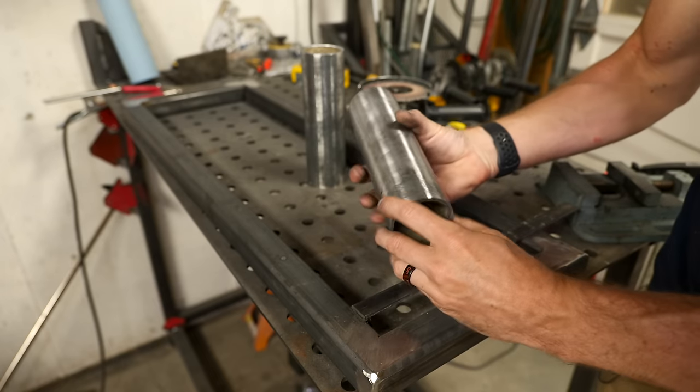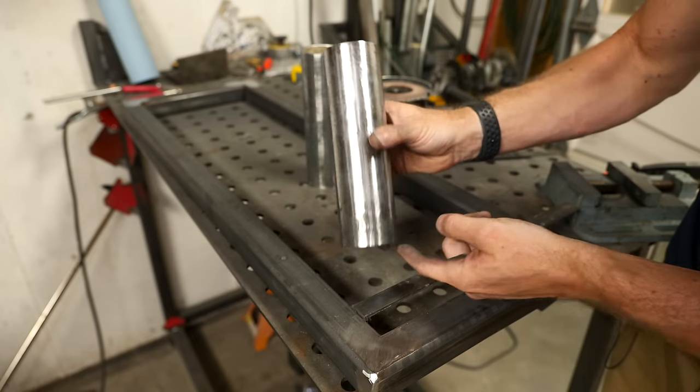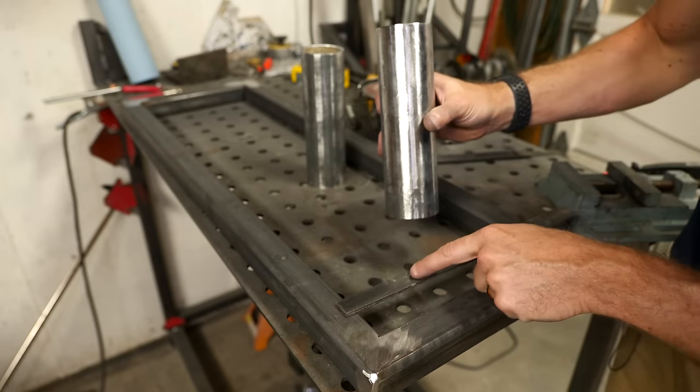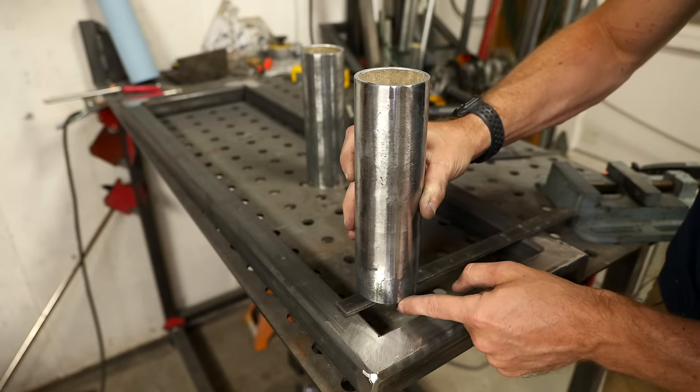These pipes are just about cleaned up and ready to be welded in, but I want to put something at the bottom of them — that'll give me a floor where I can put a piece of foam so when the barbell goes in it doesn't hit the concrete below. I've got a little strip of metal here. I'm going to weld it on the bottom of the frame underneath each one of these, which will give me a floor to put a piece of foam on to protect the barbell.